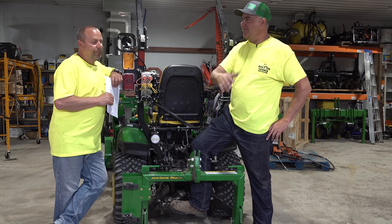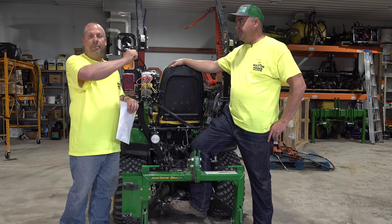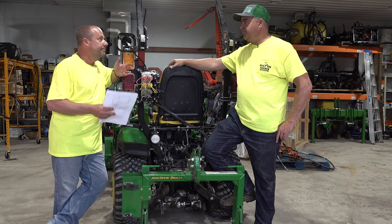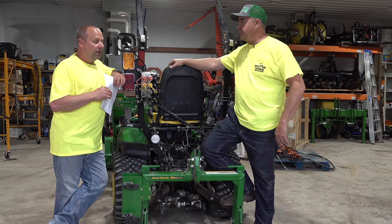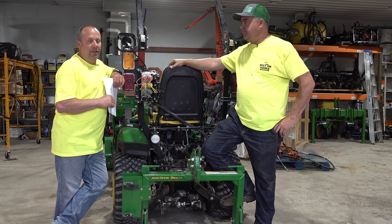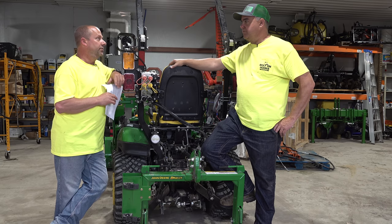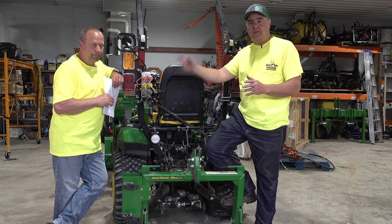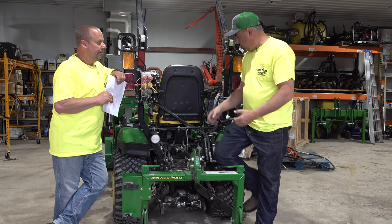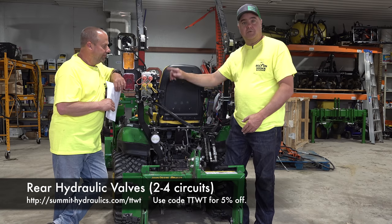It takes power beyond the tractor. So if we open up that connection — which is at the rear of the tractor, a hose that connects back to itself — the fluid has no place to go. If we try to start the tractor, the fluid can't go anywhere. We hear that squeal noise from the very moment it starts, the engine is lugging down, under strain. The engine's trying to overcome the hydraulic pump that can't pump anything. If you keep operating a tractor like that, you're going to overheat the fluid. So the logic is we have to keep that circle connected — the two power beyond hoses at the back of the tractor have to be connected to each other or connected to the backhoe, or in this case connected to the big hydraulic valve we've got here. It just extends the loop to that hydraulic valve.